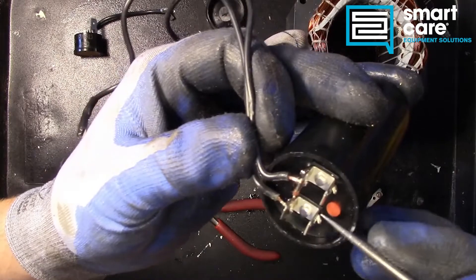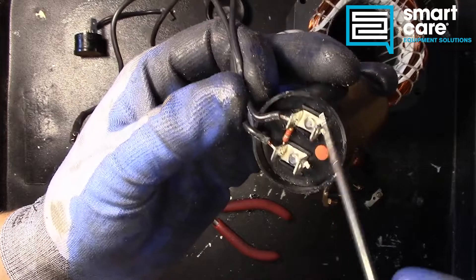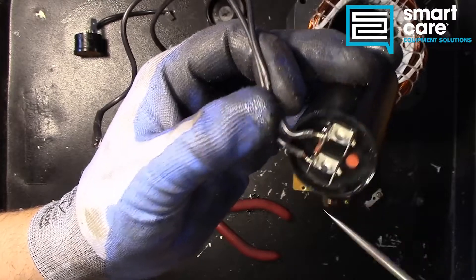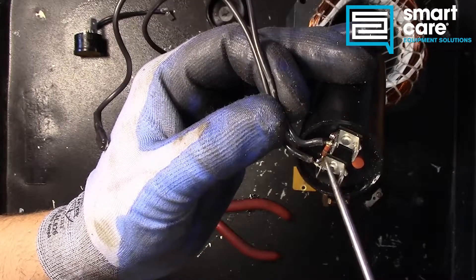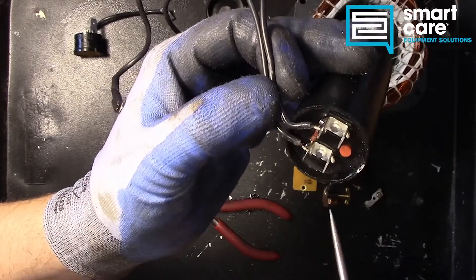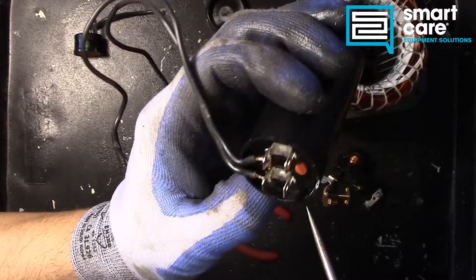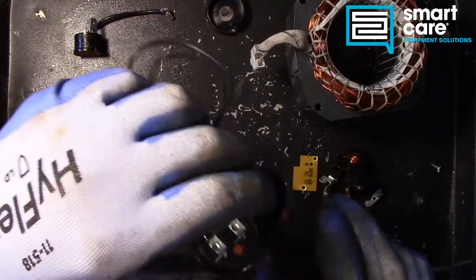You always want to check the vent and make sure it's clean and dry. The other thing is the resistor in between the terminals. To correctly short a capacitor and make sure it's discharged, the resistor creates a bleed path for that voltage to discharge slowly over time so that the capacitor will be unenergized when you pull it out of the equipment. Now if that resistor were to fail you would have an energized capacitor, so you do always want to discharge it.